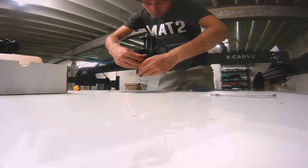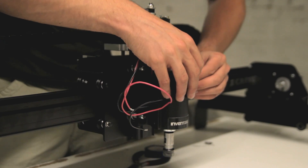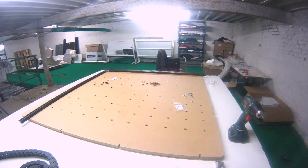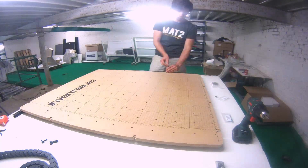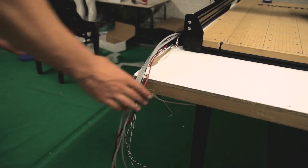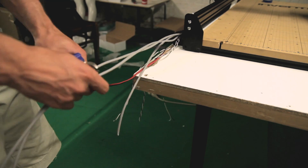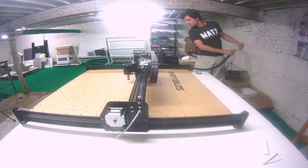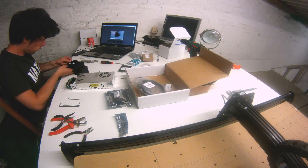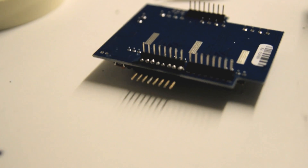This is the silent spindle I put in. In a future video I'll talk about the DeWalt 611, specifically the European version since we run on 230 volts here in Belgium — I wasn't able to use the standard DeWalt 611, so there's an adapted model for Europe. I'll explain why I changed this spindle in a future video; it's mostly about lack of power and speed. Subscribe to my YouTube channel to get those updates in later tutorial videos using the X-Carve.